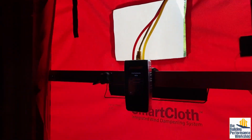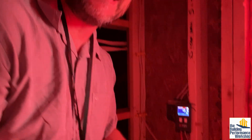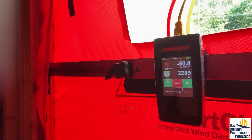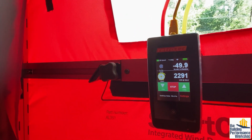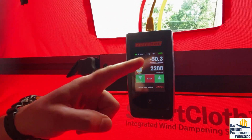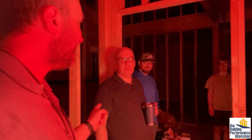Now it's much darker in here and you can't see any of the pin pricks. We have a zonal pressure test running on the house next door — not connected, remember. We set pressure to 50. Running at 23% of fan speed we've got 2,300 CFM — 6.6 air changes per hour at 50. We came from 8,550, so you guys succeeded in air sealing this place by 75%, which is pretty good for just one layer.